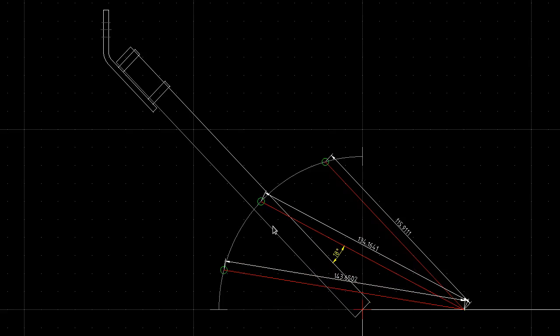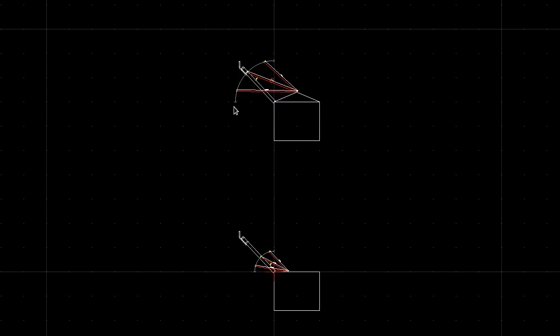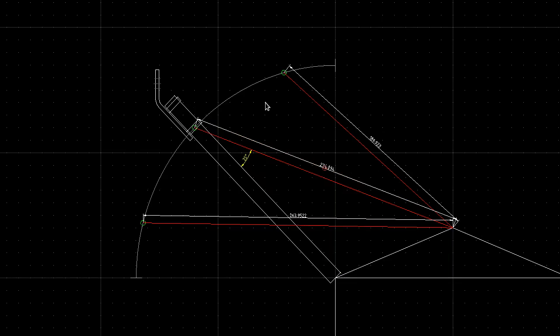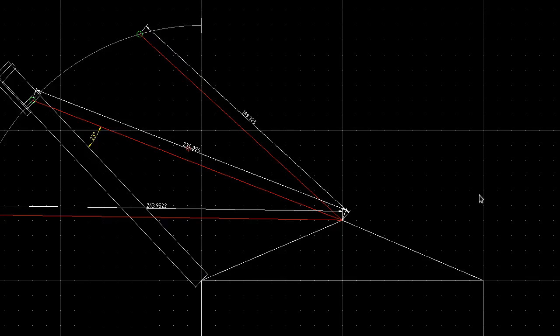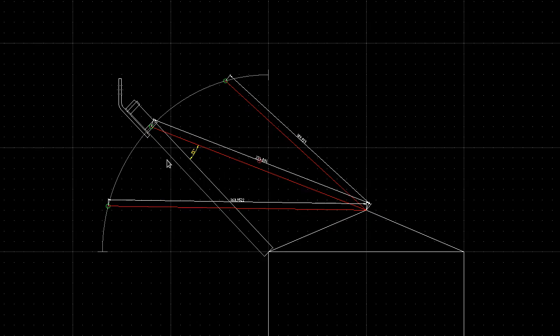So a couple of ways we can improve this situation is obviously moving this point further out and moving this point further to our optimal position of the 90-degree angle over here. Obviously we can't put it there like we just said, but what we can do is what everybody does, and that is to have one end of the spring closer to the wheel. The other end will be sort of somewhere here. I've exaggerated this a little bit, I think, although I do notice that the line between the wheel and the opposite side of the bottom of the fuselage is almost a straight line in a lot of these bushplane suspension designs, so it's kind of what I've drawn here.